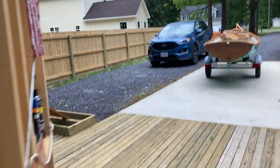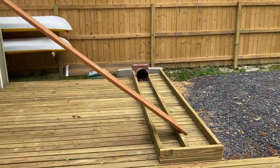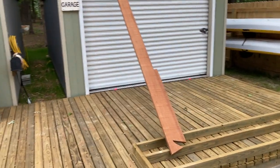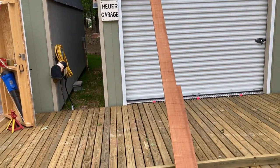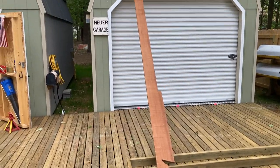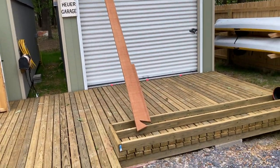Let's step outside and watch the storm come in. We started with a 14-foot piece of mahogany board. After cutting the quarter knees out of it and the strips for the gunnel, it's now eight inches wide and we're down to about an 11-foot board — part of it still eight inches wide, the other part around six. We think that'll make our keel.